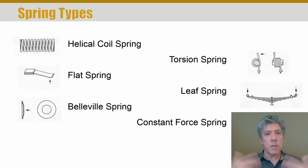But you have to pre-tension them, because as the garage door rises, you want the springs to take more and more weight off, or basically counterbalance the door. You can't start from zero. Basically, the spring can't be in what is called its free state. So many different varieties on all of these springs.